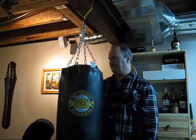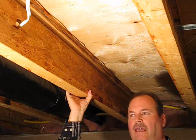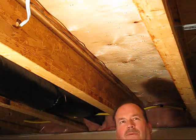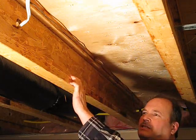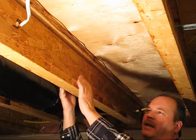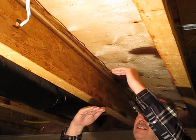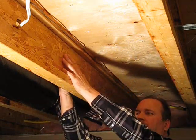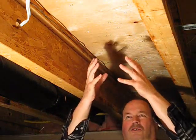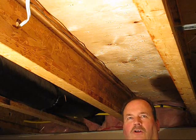I'm going to show you what my plan is. This seems to be about the only place in the basement where there's not as much furniture and I don't have a lot of wiring and pipes running through, so I think the punching bag is going to have to be mounted in this area here. I've measured this — it's about 6.5 inches from here to here. These beams are just like a little wooden I-beam with particle board in the middle and some knockout holes for wiring. I think if I took some 2x8s, ripped them down to 6.5 inches, and sandwiched two of them — one on each side of the beams — they'll add a lot of support. I'll have something in the middle to hang the punching bag on. Let's go into the workshop and see what we can come up with.